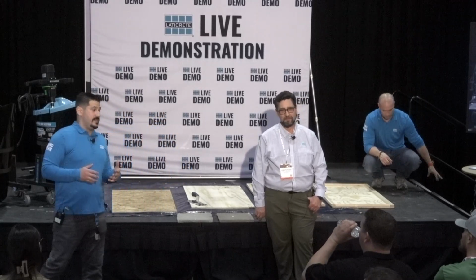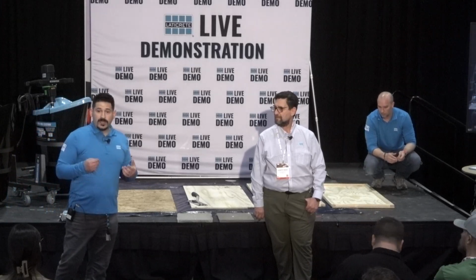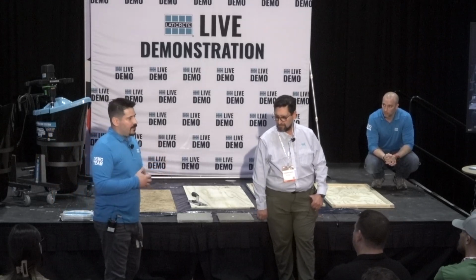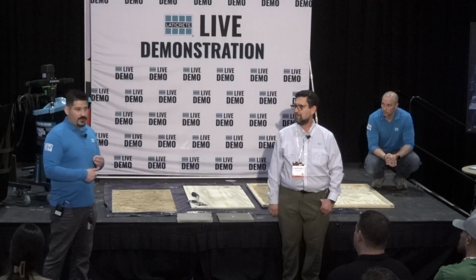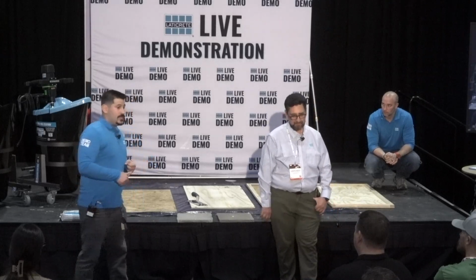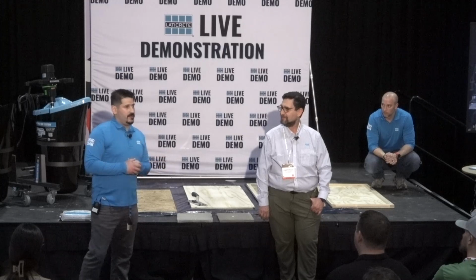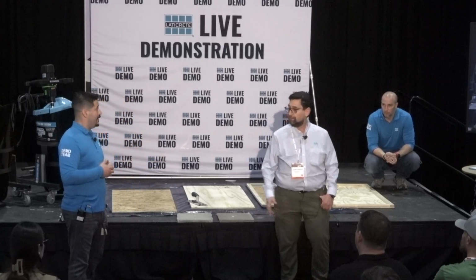We're very happy to say that the flowability of this product is very good. Typically, lightweights have a marshmallowy feel to them. You have to push them along. This one definitely flows very nicely. Some of the features and benefits: it's fiber reinforced, just like our NXT Level Plus. It goes up to 3 inches in one shot. We've also noticed, and Joe can definitely attest to this from some of the lightweight applications we've done, that they're often deep pours.